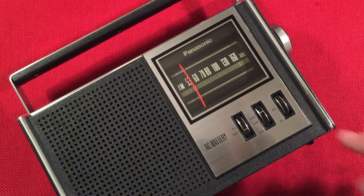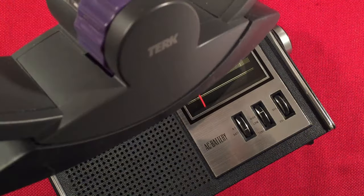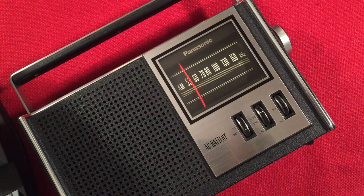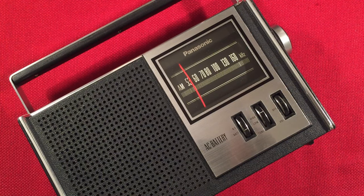Yep, I mean, a hint of CHLO, Brampton, Ontario, 441 miles, 450 watts. Pick up a little Hindi there. I'm going to grab my Terk passive loop here, the Terk Advantage. Let's set a perpendicular edge of the radio here. I'm going to turn that purple knob to tune the antenna to match the radio's frequency. Very receptive to that. Nice.